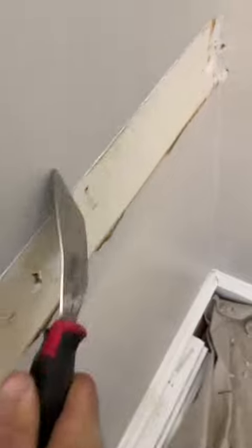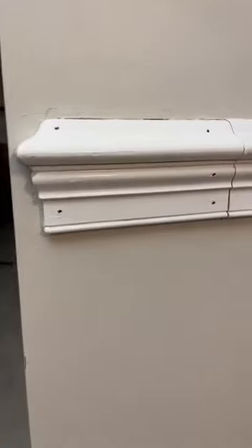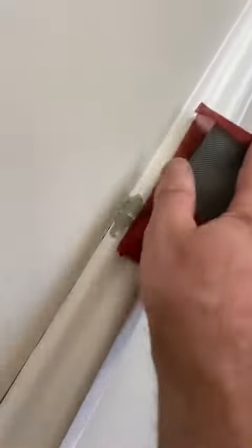We've got this chair rail over here. It's missing some because the wall was blown out into a half wall. So I'm going to reclaim some of that and put it over there. I'll remove this mud and sand it. And then we're going to scrape down all these high spots in preparation for the mud. We'll slap a first coat on there just like that — I'm using five-minute mud. Here's my reclaimed piece. I kept the return end on it, cut it to length, slapped it in there, got it shimmed up a little bit, and nailed it in.